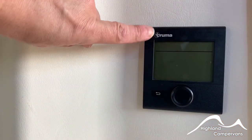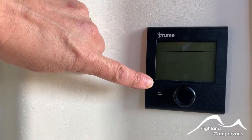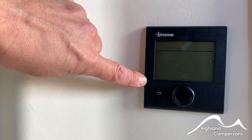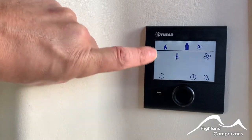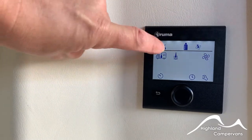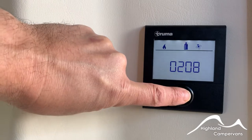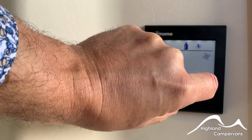The water heater controls are located at the head of the bed. To set the water heater up, make sure that the drain valve is closed. Turn your taps on for hot water in the kitchen and draw the water through until there's a consistent flow. Press and hold the switch and you'll see the display light up giving you instruction as to what the status is. This is a gas-only unit — at the moment it's generating room heating, but we've got the option for water as well. Tap on the dial and you can use it to scroll through the different characters and settings.